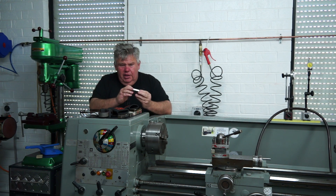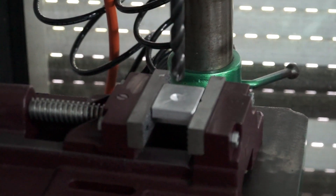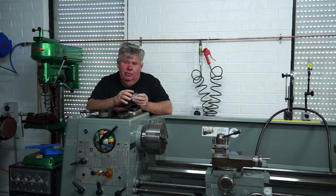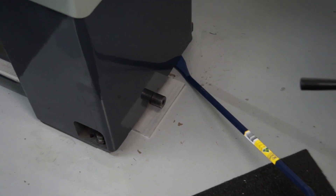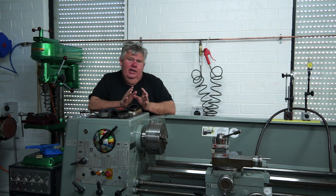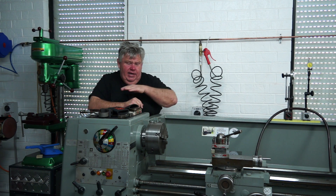I made some feet from little aluminium blocks I had lying around — roughly 40 by 50 millimetres. I drilled a small hole in the top centre, put some lithium grease in there, and placed them under the screw jacks. Using Tom's recipe, I put a big single hex impact socket down under the tailstock end right in the centre as a teetering point, and concentrated on getting it level in the cross slide plane first, then level in the bed lengthways — the Z axis.